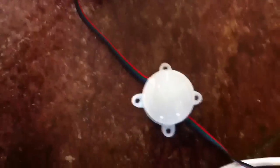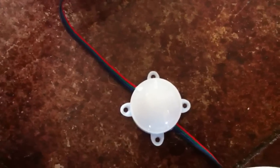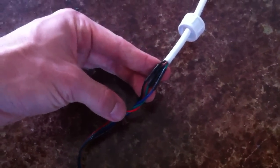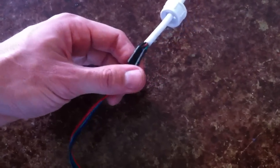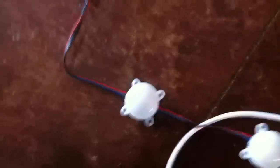Coming out on my four-core, for this setup I'm using these 6803 pixels. I just have my four wires again soldered on there — my two power wires and my clock and data wire in the middle. You can see I've got a pretty good long string of them here. I think there's 40 in this setup.